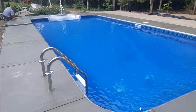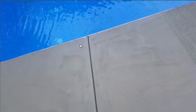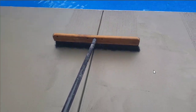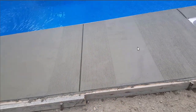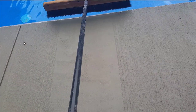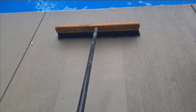Now if the sun's out, you're going to have to be working pretty quick. Today was about 70 degrees and it was partly cloudy so we didn't have to work too fast. We've got the surface all magged out, and now we're just pulling that broom over it nice and slow and even so those lines are really straight.